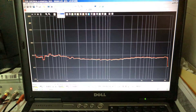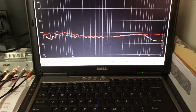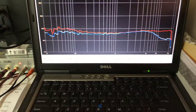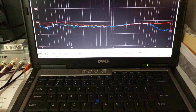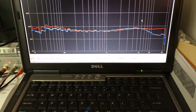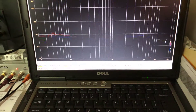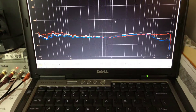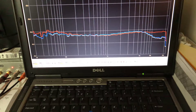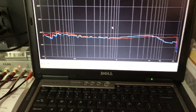I'm going to go to the other channel and let it settle down a little bit, then mark it with blue. You can see that there is a little bit of frequency response difference at high frequencies — around 2 to 3dB. I'm assuming this is partially related to capacitors that I need to attend to on that signal path, which should be addressed next.